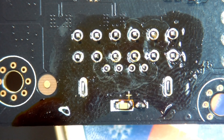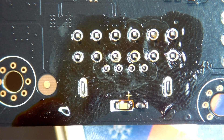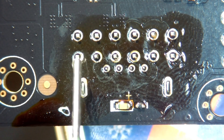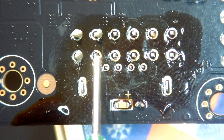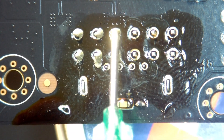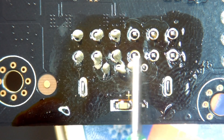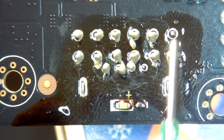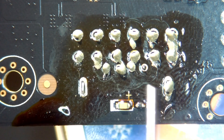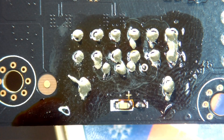This time we're not going to use low melt — I'm actually going to use normal leaded solder, and a combination of some solder paste. The paste will just facilitate soldering to make sure I get a good joint. And the same procedure in reverse. Whoops, I missed a pin there.